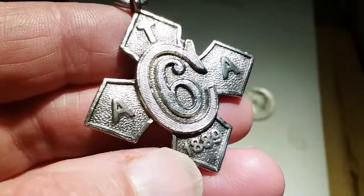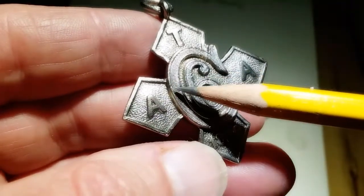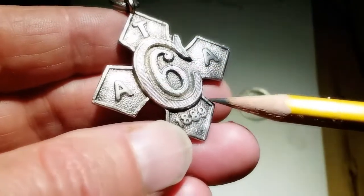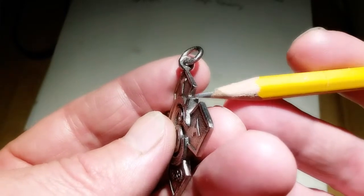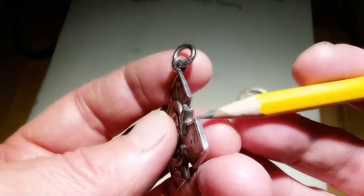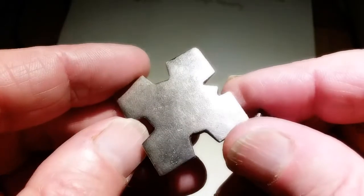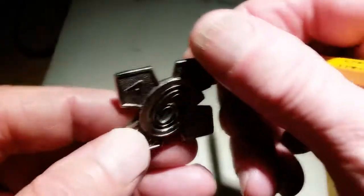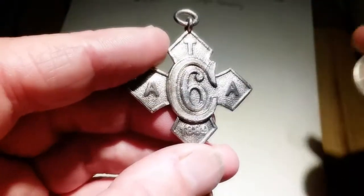All right, let's clean these up and see where we're at. Huge thumbs up on the DIY do-it-yourself electroplating silver process. Note how the process dissolved gunk around all the lettering and numbers. I'm noticing that the shoulders of the metal showing copper as a base metal are silvered over, including the jump ring. The back is absolutely beautiful — that's the original silver plating, look at that shining.